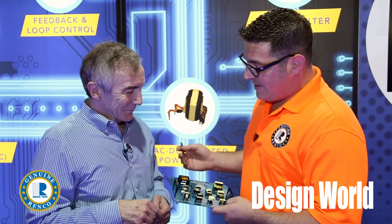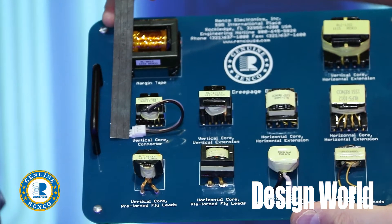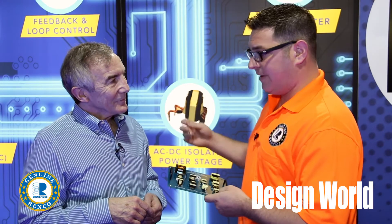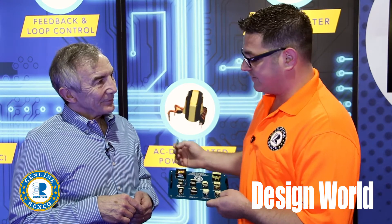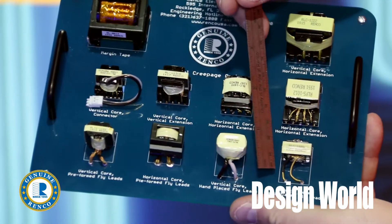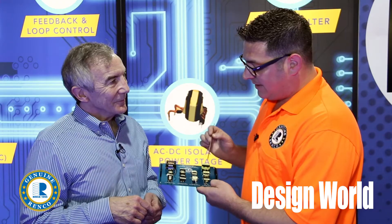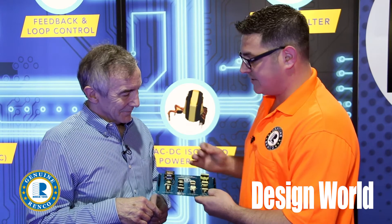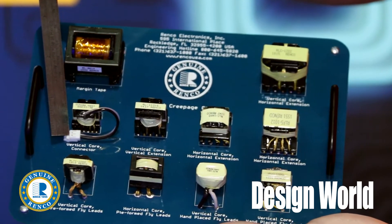For example, we may have an EE 16 that only has to do a few watts, but it's only 16 millimeters cubed roughly. How are we going to add another 12 millimeters to space it out? One of those options could be to add fly leads with a connector. We also have this very small package capable of 15 watts, but we may want fly leads for space constraints. If I have to have a bobbin sticking out, that's just eating up board space. With fly leads, I can have my secondary components stuck in between the leads.